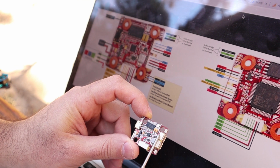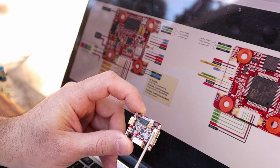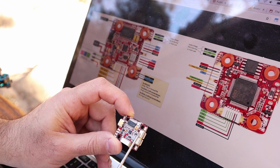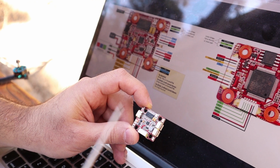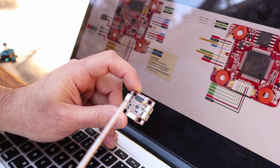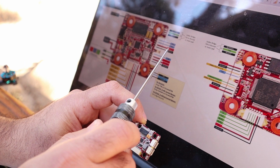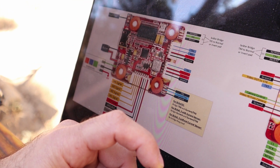Over here, this is the connector where you would connect TBS. Actually, you could connect FrSky here as well. The point is that a 5 volt receiver goes here. In Flight 1, I know it sounds odd, the out or the signal from the RX goes to TX1. I know that's different. And telemetry always goes to RX3. So as long as you get that right, you'll be okay.